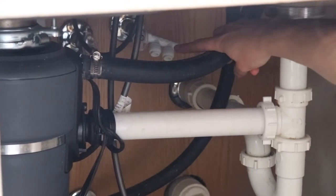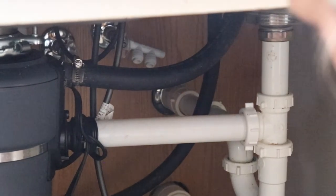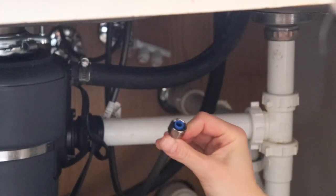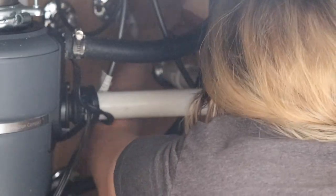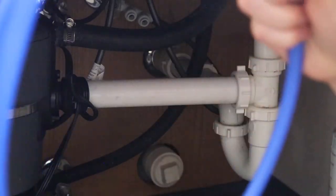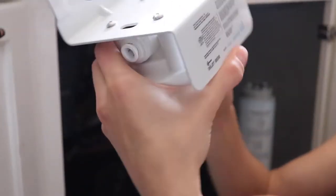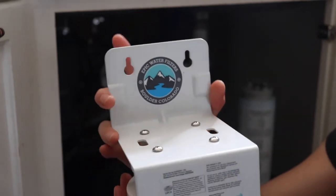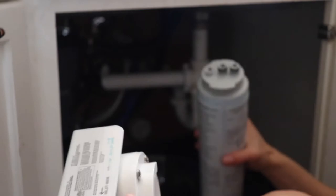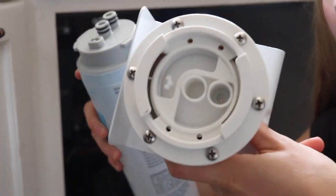That's now installed. Use the wrench to connect the lower end of the cold water line to the top of the white cold water supply adapter you just put in. Next, install the tubing — there's blue tubing and white tubing. Install the blue tubing on top and the white tubing on the bottom. Push really hard into the holes and then try to pull them out — if they come out, they're not tight enough. Now install the filter itself. The company gives you screws to fasten it to the bottom of your sink, or there's a Velcro option. Look at the two ears on the side and find the corresponding holes to secure it.